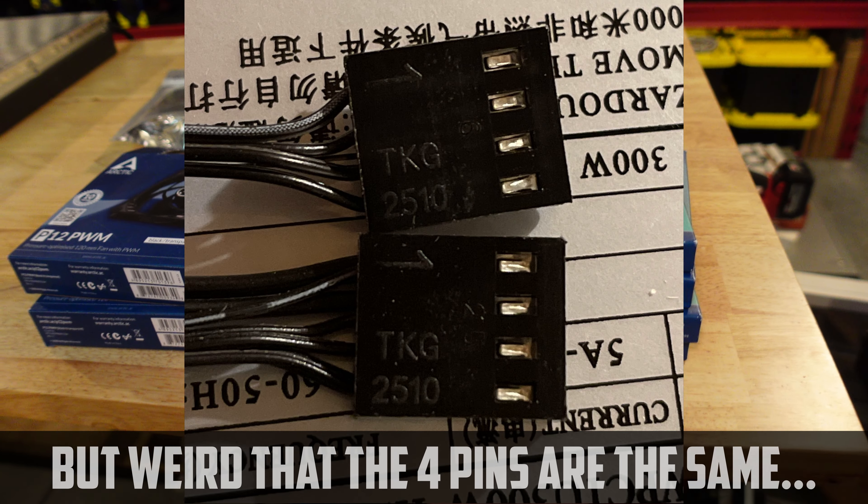I'm amazed by this — I can't hear the miner at all running next to me, that whine is completely gone. By the way, you don't need a custom cover if you want to do this at home. Just take the lid off, take out the server fans, plug in your own fans, screw them to the heat sink, and call it a day — it works perfectly fine without the lid. I only built the cover for looks and to keep kids' hands away from the board and controls. I'll add fan grilles and paint the cover later. Power draw is 257 watts at the wall with 240V. Let me know what you think in the comments, hit subscribe, and I'll catch you guys real soon.